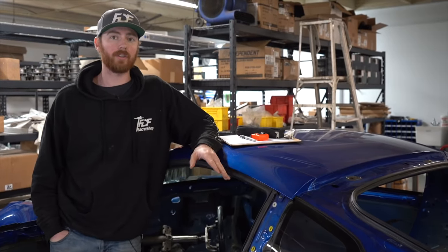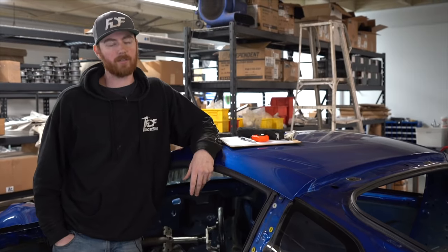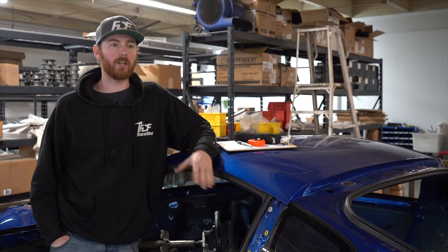I was known for making high quality roll cages that I prominently TIG welded just for the aesthetics, and also when you're using alloy steels, for the most part it did have to be TIG welded anyways, and that really instills the tight fitment policy that I run by, and that everything needs to fit perfectly. You can't have any gaps anywhere, or else you're gonna have a bad weld that, especially with materials like chromoly, are gonna be susceptible to cracking and breaking. So everything needs to fit perfectly.